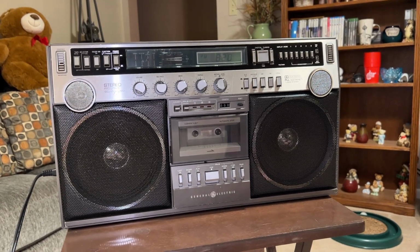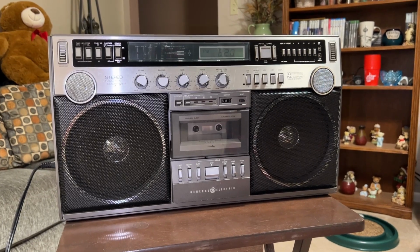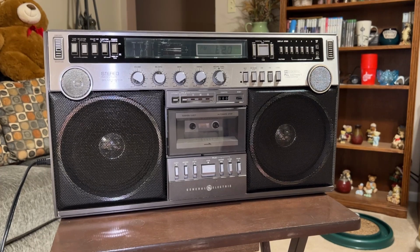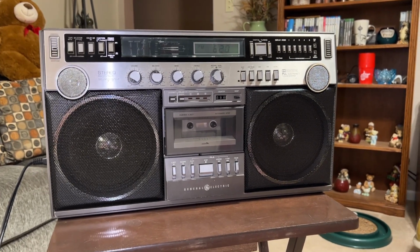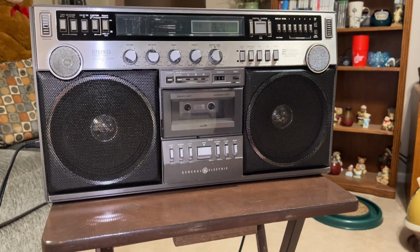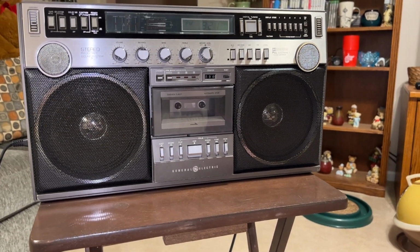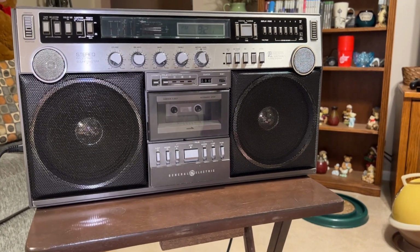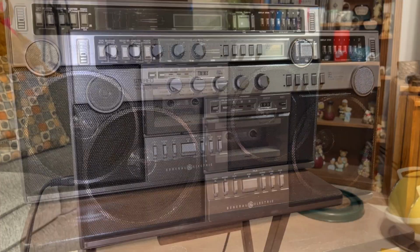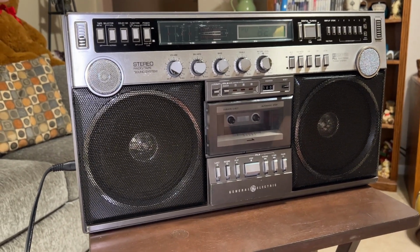And I keep saying that because, you know, you got these Bluetooth speakers today that boast all this power, and they even boast more power out than you're putting into it, and people believe it. I'm like, how? Why? I'm not going to deny Class D amplifiers and their efficiency, but Class D amplifiers also don't sound that great. Yeah, they put out a lot of bass, but the rest of it, I can get into another subject there. It just doesn't sound that good. I'll take less efficient Class AB amplifiers for a louder and better, clearer sound quality.